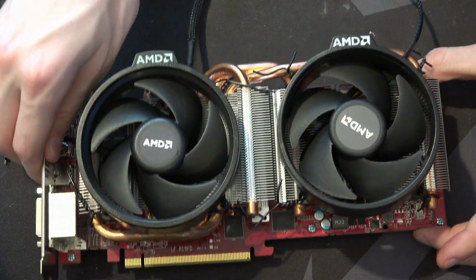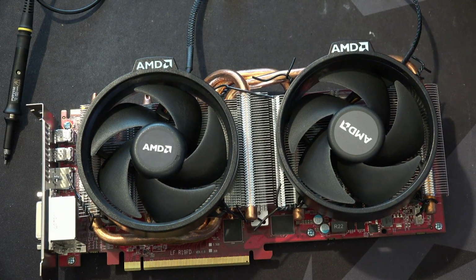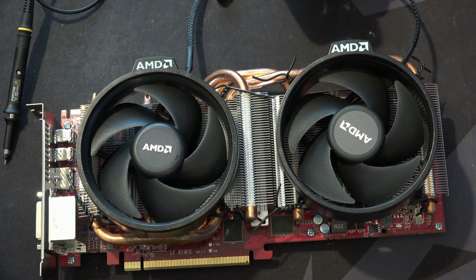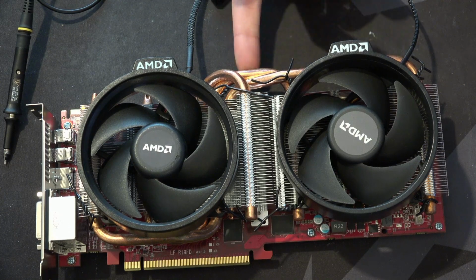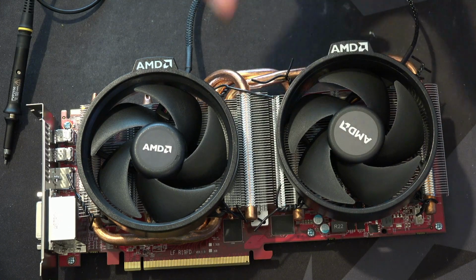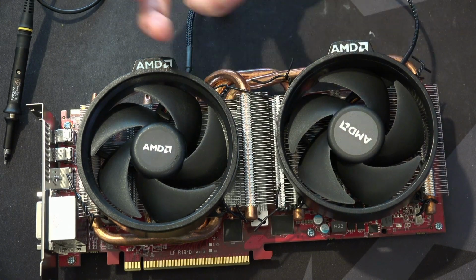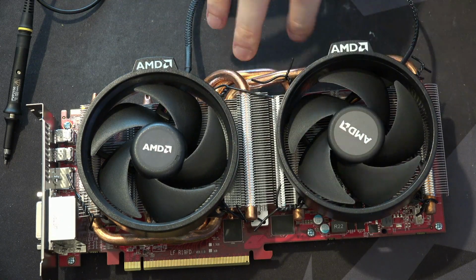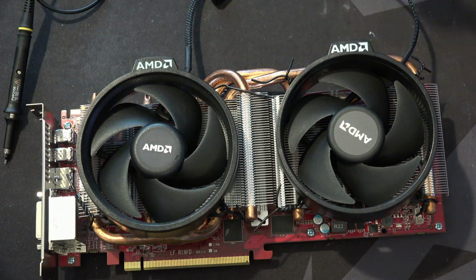And for competitive, you might say, oh, but for daily usage, this doesn't have any point. And I'd agree, 20 megahertz, well, I don't know. Personally, the thing is cap mods are really low risk. The main issue you can run into with capacitor mods is if you add capacitors to memory, basically your main concern is that you might hit the overcurrent protection of the voltage regulator during the soft start procedure, because if you have a whole bunch of capacitance on the output of the regulator, it needs to charge up when you're starting the voltage regulator, right?